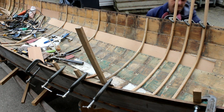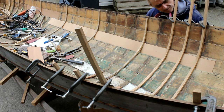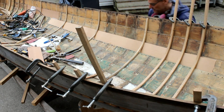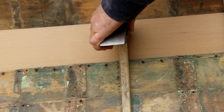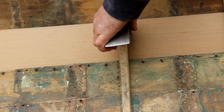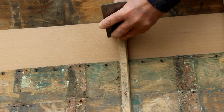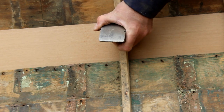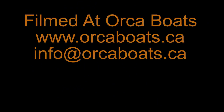Here we go with the final offering of the plank onto the boat, fitting everything in place as marked. A little bit of adjustment here and there, and we can begin to clench nail first to the few ribs that are in there, using copper clench nails, with the clenching iron hooking the end of the nail over. Then we follow up with shorter clench nails, joining all of the planks together. If you've enjoyed this video, be sure to give us a thumbs up and click subscribe.